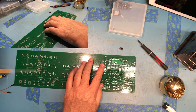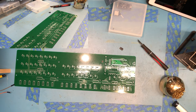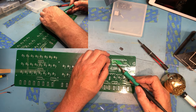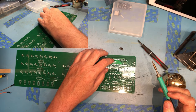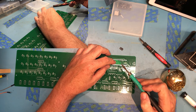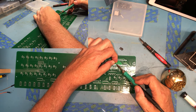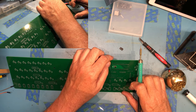I've got the IC sitting here. Pin 1 is rotated to where it goes on the board. I'm working with the best magnification I have glasses-wise, since my close-up vision is no longer what it used to be. We're just going to add a little bit of solder to that first pad, slide the device over into place. We're going to see it's not quite square - still not quite square, a tiny bit more. It's square now and the pads are reasonably centered.